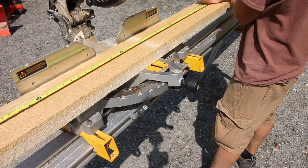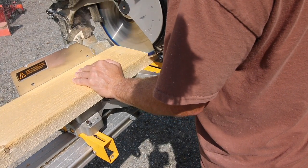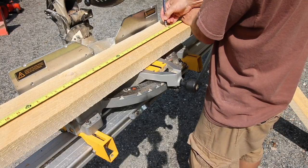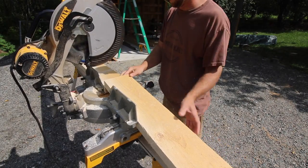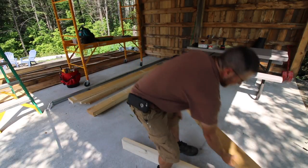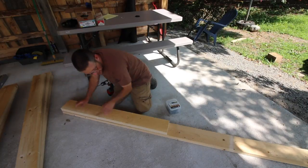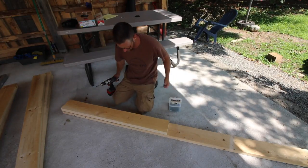Now that we have our four cut to 100.5 inches, I need two of them at 48 inches long. So we have all of our 2x6 pieces cut — we're gonna build our own beam. We're gonna need three pieces of wood. We're gonna square up our edges and flush up our sides. Being rough sawn lumber, they're most likely not all gonna be the same width — and they're not, which is fine. It'll be on the inside of the wall; we won't end up seeing it anyways once we're all done with the project.